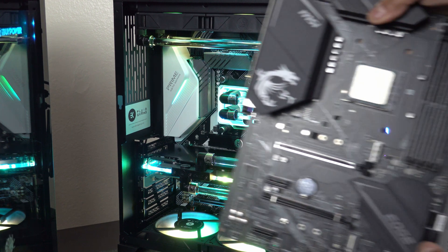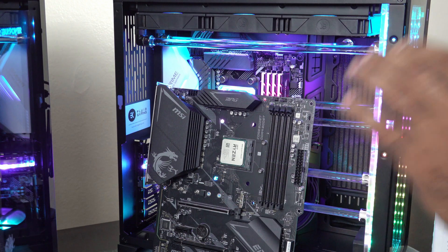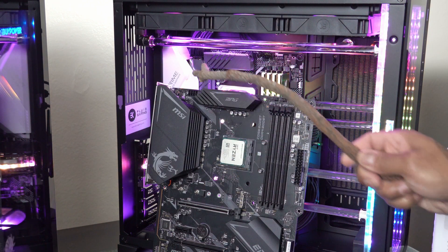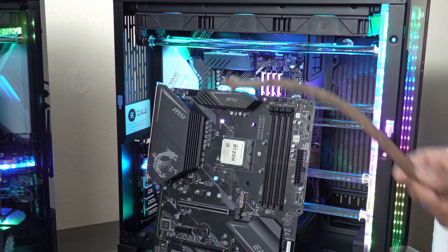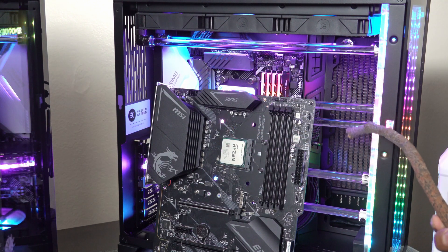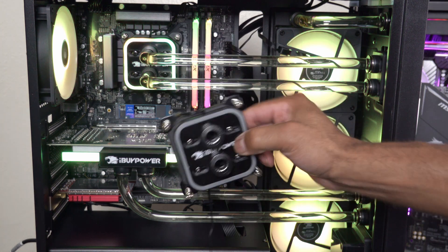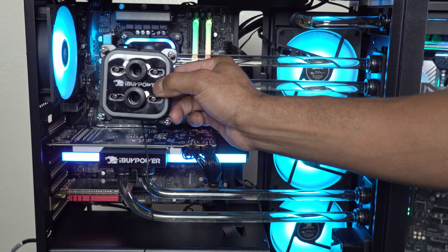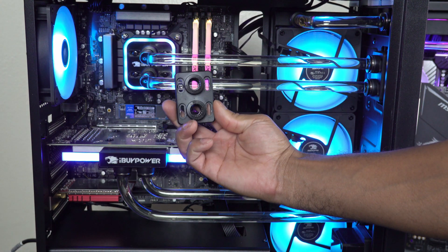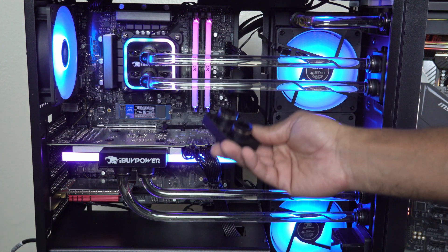An easy example: this motherboard here is by MSI — it's a black motherboard. With this style of motherboard the whole system looked better, but the CPU was placed slightly differently than the CPU on the ASUS X570 Prime white motherboard in the EK system. I actually had to cut new tubing to properly get the CPU water block to fit and match up the distroplate. If I decided to change the motherboard for the iBuyPower Element CL, I may not have had to cut new tubing because the block would slide back and forth to allow for different distances. And in terms of height, it attaches to the front distroplate and goes up and down as well — a real time saver for anybody wanting to do additions to the custom loop.